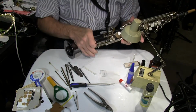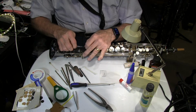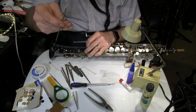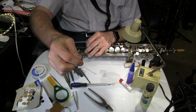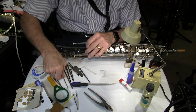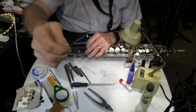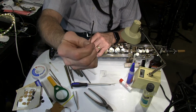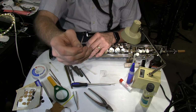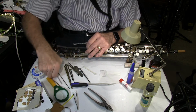I need a collection of little screwdrivers like this. Oh, by the way, on that spring hook, before I leave that idea, that's a professional one there. You can see that it was commercially manufactured, but I have some that I've made myself. This is a crochet hook, and I've done the same. It already had the hook, of course, and I took a 3-cornered file and filed a notch in the top of it. When I'm dealing with a smaller, closer situation, that one can be more helpful,